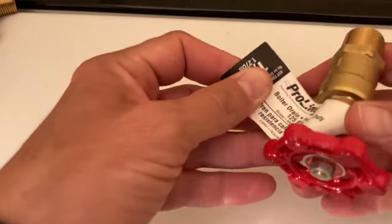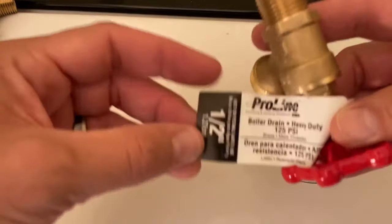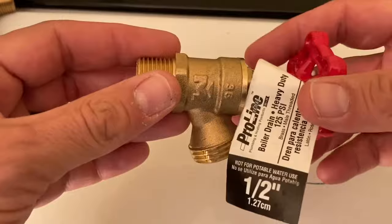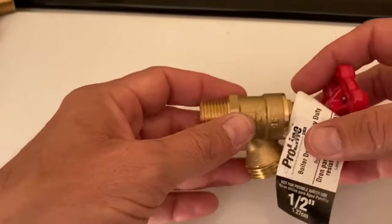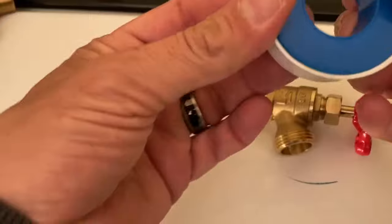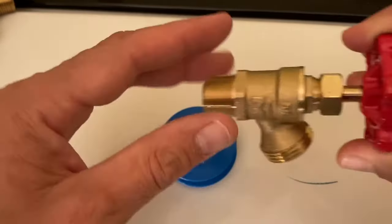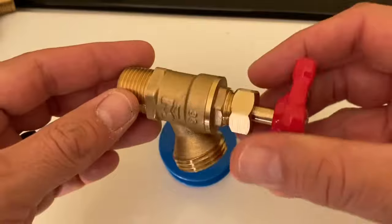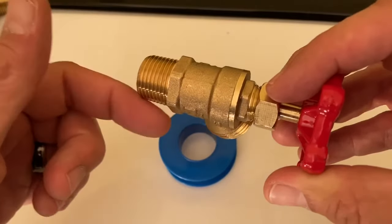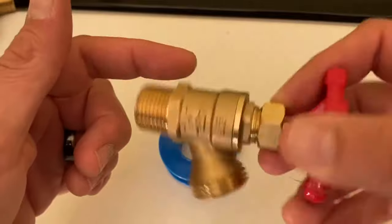The parts I got I just picked up at my local hardware store. What you're looking for is a boiler drain, heavy-duty, half inch — that's the size for all of these. It fits into the threaded slot for the hot water and the same for the cold water. Now you're going to take the tag off and get your Teflon tape. The specific way to wrap it is in the opposite direction that the fitting is going to turn. The old saying is righty-tighty — so you don't want to wrap the thread in the tightening direction, you wrap it the opposite way.